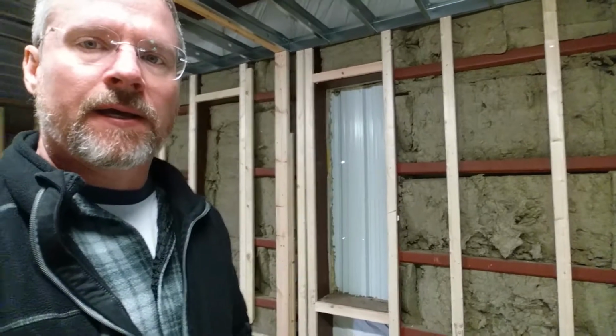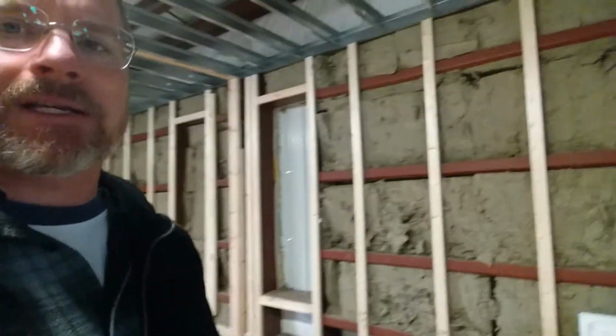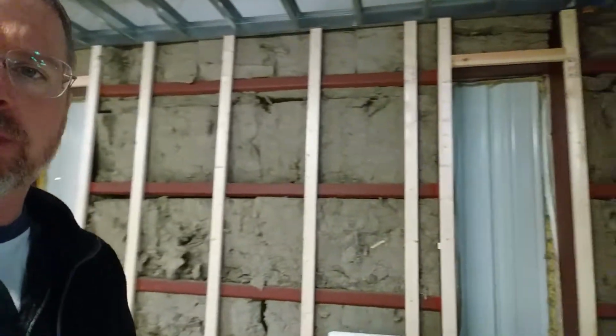And this room that I'm standing in right now is room H5. It will require 25 sheets of drywall on the walls, and on the ceilings we're looking at 15 sheets. The exterior wall you see over my shoulder, with the insulation in it, will have conduit run in it first. To get us off to a speedy start, since you're arriving with Tuesday, Wednesday, Thursday, and Friday as work days, I think I'll push to get the conduit in that exterior wall at least before you arrive. And we'll have these window areas where there's no insulation covering those holes.